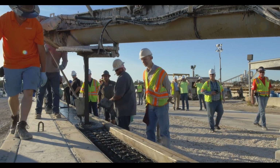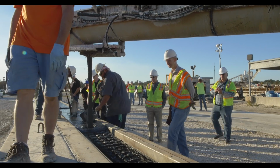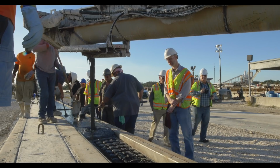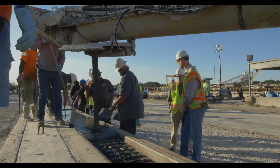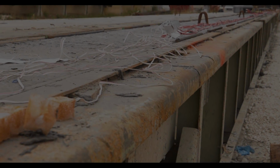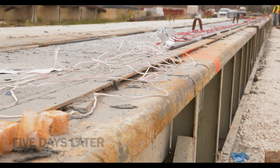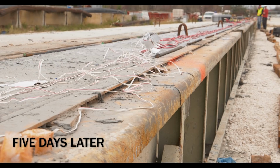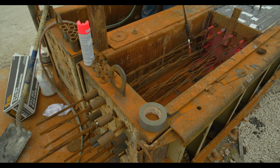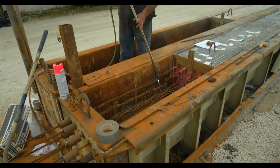During the production phase of our testing, we wanted to prove that unlike other UHPC products, components precast using Cor-Tuf UHPC would be free of voids and would show no inward shrinking while the component cures. Working in partnership with the Florida Department of Transportation, 15 strain gauges were installed in each piling. When the pretension load at each end was released and transferred into the concrete, it was measured and, as predicted, showed no movement of the pretension cables embedded within the piling.